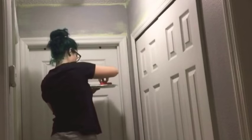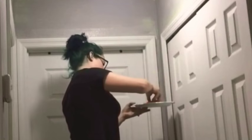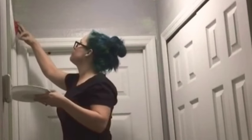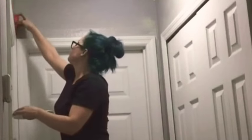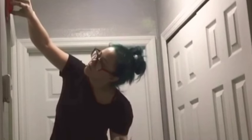Next I used this little flat-edge type tool to get it as straight as I could around the frames of all the doors — because this is what I call the hallway of opportunity, because you don't know what each door is going to take you into. I decided to use this little tool because I found it to be pretty easy for just these long straight shots instead of cutting in by hand, which is pretty tedious work and is how I did the ceiling edge line.